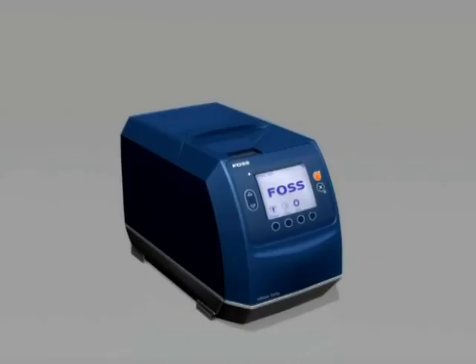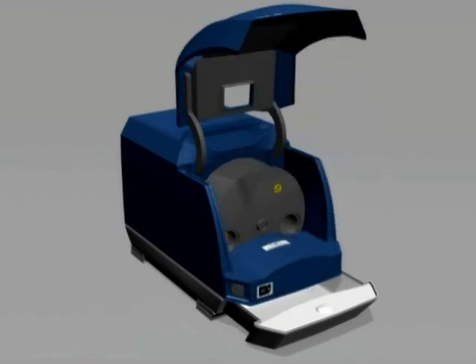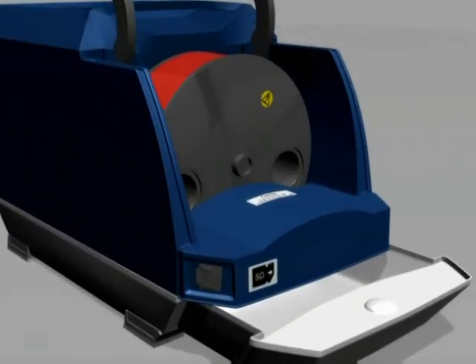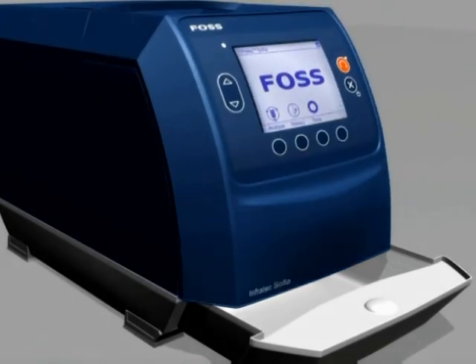To change the sample cell while the instrument is powered on, pull out the sample drawer and lift the instrument hood exposing the sample handling wheel. Place one hand on the drum of the sample handling wheel to keep it from moving. While holding the sample handling wheel in position, remove the front cover. The cover is attached to the nut, so it is removed when the nut is loosened from the cover to be lifted away. Then lower the hood of the instrument back to position without replacing the drawer.